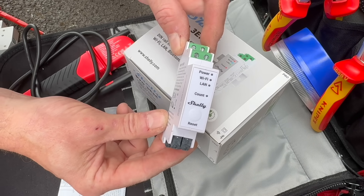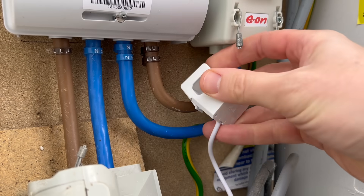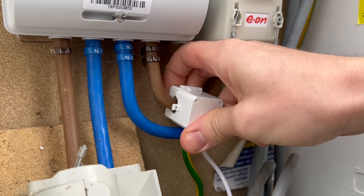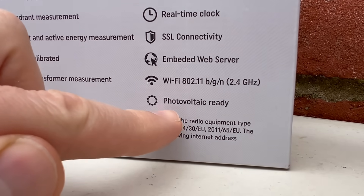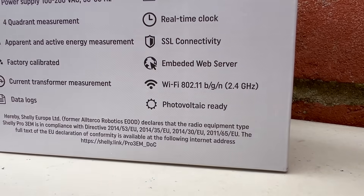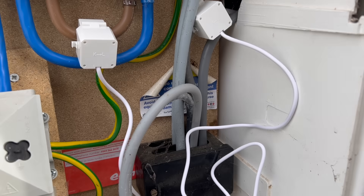But to be fair, we've barely touched on what this device from Shelly can do. We've got these other two CT clamps to play around with. We've only got the one phase, but what we could do is hook these up to the main meter tails for the whole installation — that would tell me exactly how much I'm either importing or exporting at any given moment, which the Pro 3EM does brilliantly as it's PV-ready with two-way tracking of power flow. Then I could pop the other one around the tails after the Henley block and measure how much power the actual installation is using. So with one simple device I've got solar generation, export/import values, and what I'm using at any given moment. As a father of two teenagers, I can confirm this is like having the ultimate weapon in the war on wattage waste.